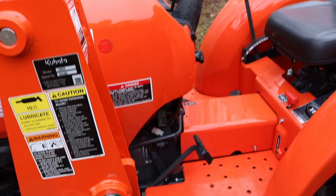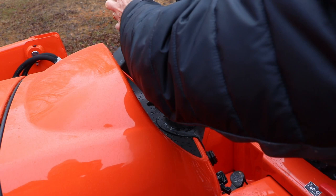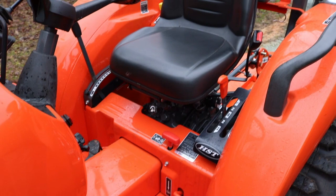Okay. Let's take it one step back just to make sure. And the reason I say this, on the yard, we have customers come in and they play with the levers. Make sure your throttle's pulled back, and again, symbols of a tortoise and a hare. Slow and fast. This is your hand throttle. Make sure it's at low RPM. Press the clutch, crank it up. If it doesn't crank immediately, turn the key counterclockwise, just to make you aware, this is a glow plug. Once the tractor's running, I let it warm up for a few minutes, let it pick up some oil.